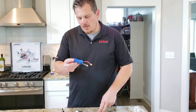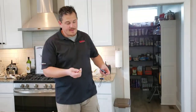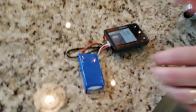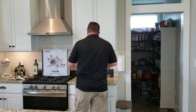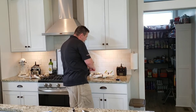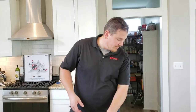Now we're going to check — this one's been charging for about 10 minutes. We'll pop it out real quick and show you the charge: we're at 76% charge. We've got a little bit to go, no big deal. That's a pretty decent charge rate actually — if you're at 1000 milliamp hours and it says 1500 milliamps charge rate, that means you're charging at 1.5C, which is pretty good for a small el-cheapo charger.